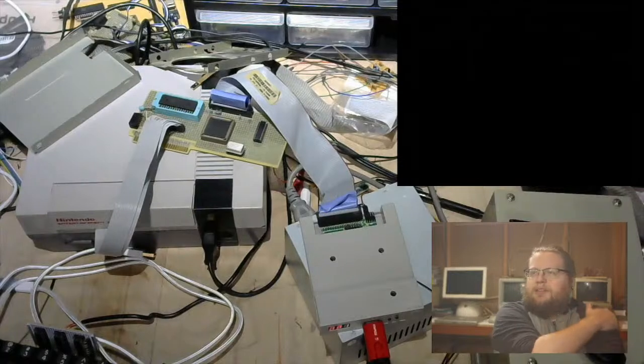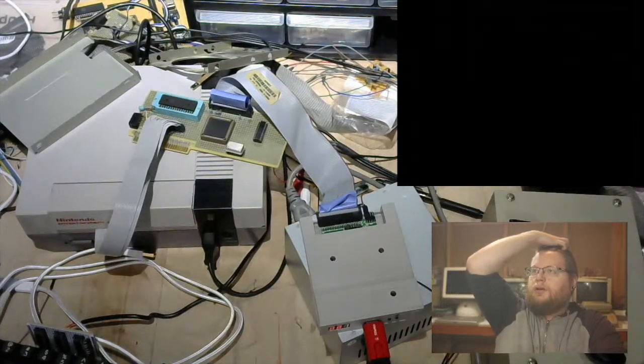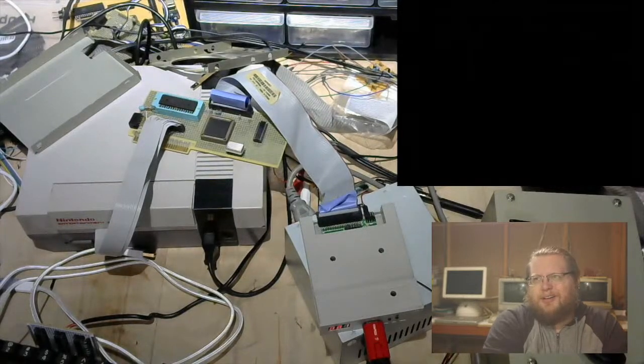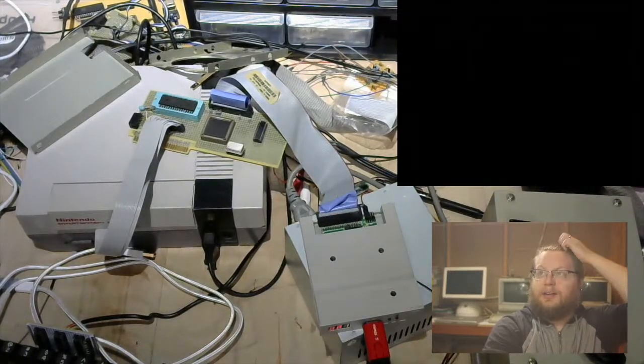Let's pass a 16-bit pointer to some kind of command block, wherever that may be in memory, in X and Y. Does that sound cool? Because I mean, we could just do the exact same ProDOS thing. It wouldn't really be that much harder. We just need to, we're already pulling the status register. Then the next 2 bytes on the stack are the return value. We could do the exact same thing.